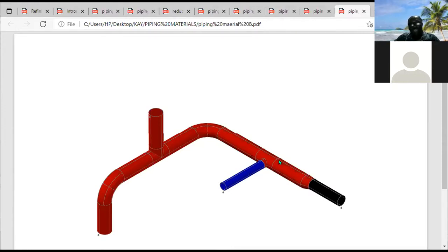Okay. Then let me exhaust the shape. After the reducing T, along the main run, a pipe was attached to the T. After the pipe, they decided to reduce the pipe from 10 inch to 8 inch again. So they had to bring in a reducer. This is going to be a 10 by 8 inch reducer. Actually, this is an eccentric reducer that was used. But now, before we diverted to this, we're talking about OLET.